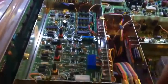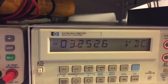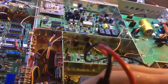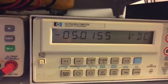Before I get my multimeter in here, I'm going to stick the probes in there like so. There's nothing on the meter right now — flip it on. Getting 3.2 volts, and that chip is getting hot. So if I pull this plug off again and measure that supply right there, then pull the chip off — 5 volts, like it's supposed to be.